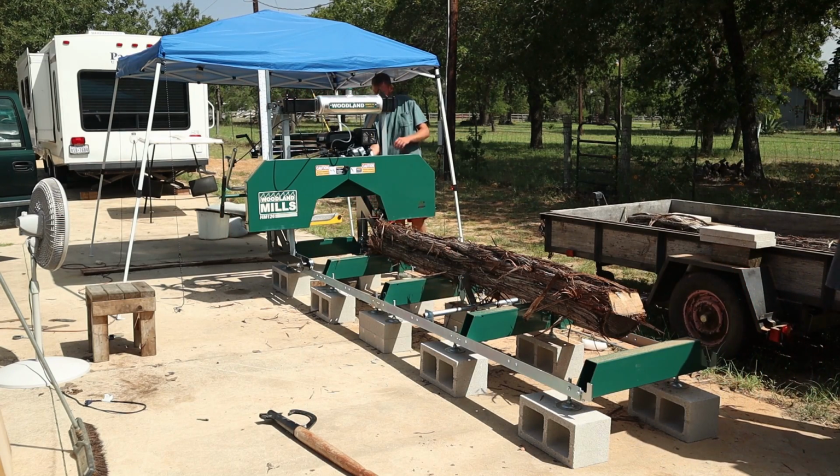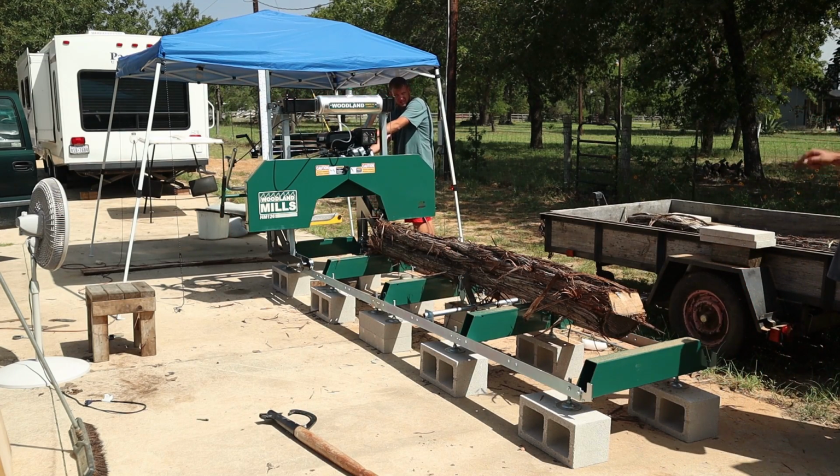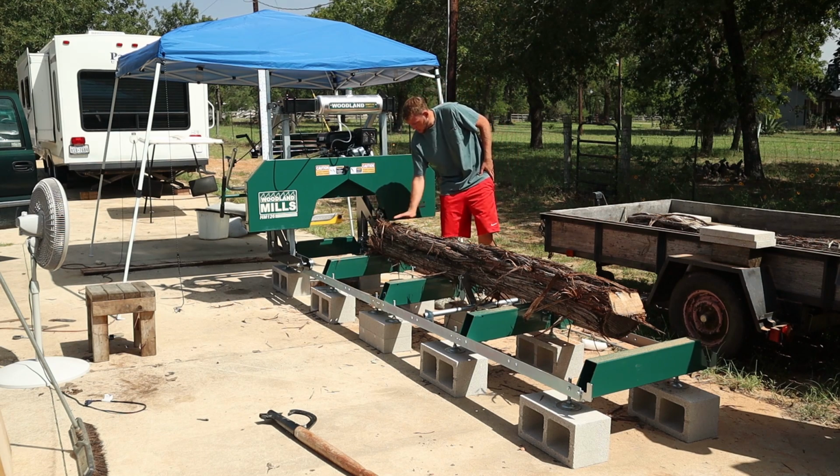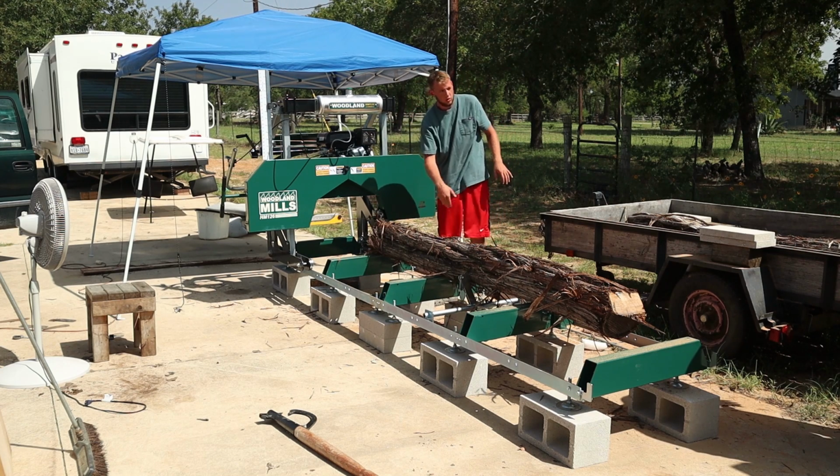It's pretty flat, I guess. Yeah. Or are you supposed to go down once? Huh? Are you supposed to go flat on the bottom and then cut another side first? No, you cut the flat first, and then you get this, and then you rotate that square corner down the bottom.